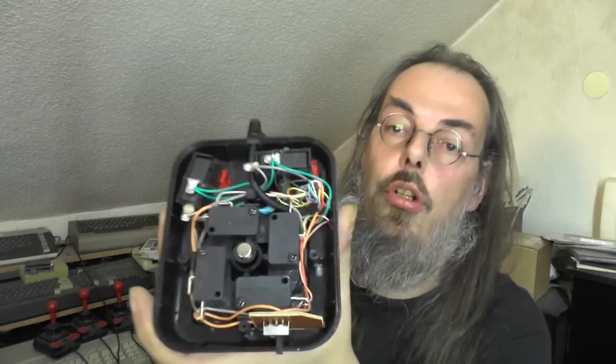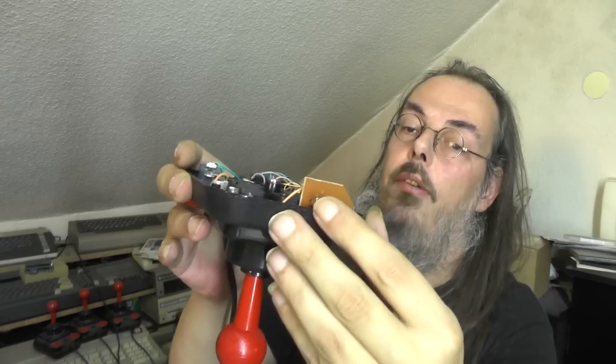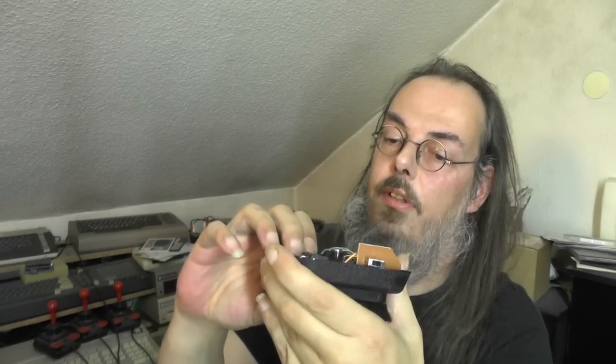And the cable should have all 9 pins connected through. This is just a switch to turn off the top fire buttons, the extra fire buttons off. Those ones. But you can actually fit in auto fire. All the 9 wires are supposed to be connected through, so I think you can also rewire it to be MSX compatible. Yeah, I really think I butchered those 4 switches from one of my new ones and used them as spare switches for the fire buttons. Yeah, a little bit disappointment that those are cheap Chinese switches.